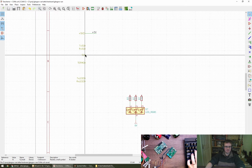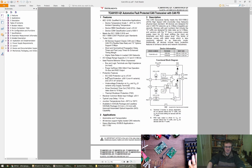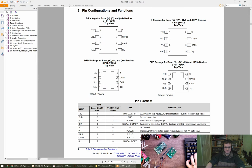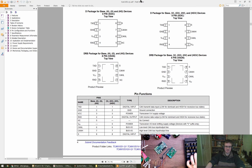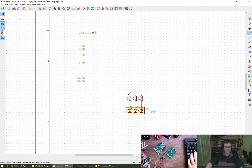So I am going to put, let's have a look at the data sheet for this part. Is that silent mode positive or negative polarity? So silent mode, active high. So I think we can put silent into red probably. That'd be nice, because then it's kind of safe or whatever. So that's the red one there.